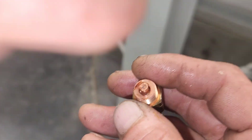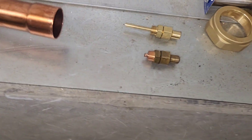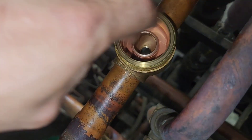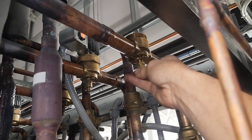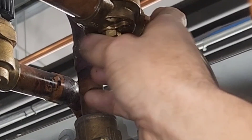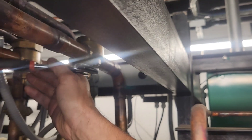You can tell it's broken — here are the two next to each other. Look down in the bore to make sure there's nothing foreign in there, then carefully screw in the new manual stem. Tighten it down good and tight with a wrench and then put your cap on it.